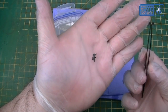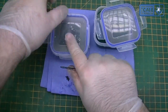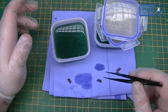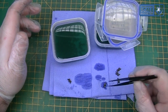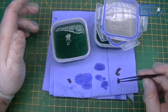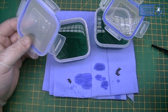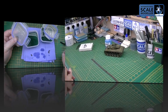If you grab the other side as well — just to show you that both are the same — obviously I added a little more fluid to one side, but it doesn't matter. It's not the amount, it's how concentrated it is. Because we thinned it with water, it's taken it down — it doesn't have to be exact, but the result is exactly the same. Nice dark rust colour. I'm going to pop them back in so we don't get the sides mixed up. What I'll do now is take these out, let them dry, then assemble a full length and come back to show you the assembled result and the colour they've gone.